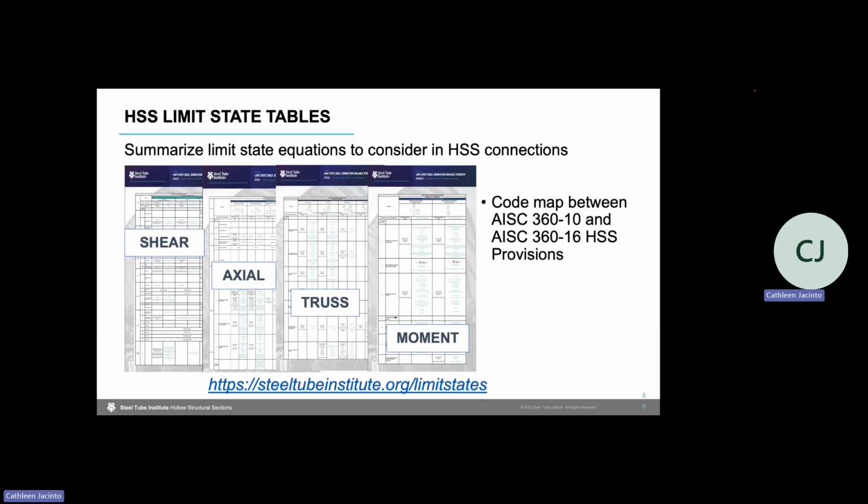Before we dive in further into all the limit state checks that we need to make on our HSS column, I'd like to point you to this resource. STI developed limit state tables to summarize the limit state equations to consider. There are 4 different tables separated by type of loading. We have shear, axial, truss, and moment. And each of these tables has several HSS connection types to select from. The equations to check are based on AISC 360-2010 as well as 2016 and are summarized on these tables that are free to download on the STI website at the link below.